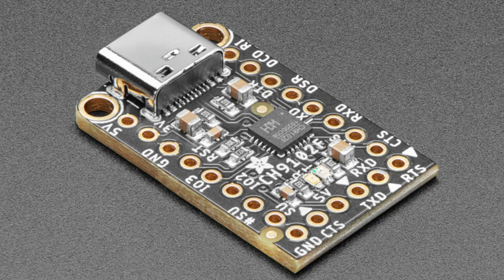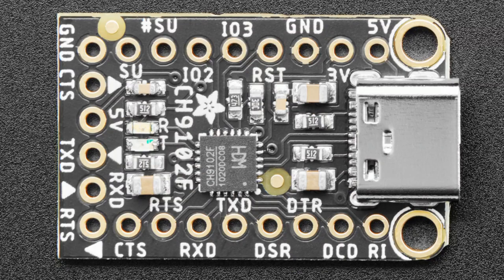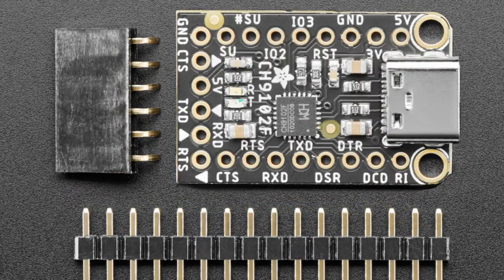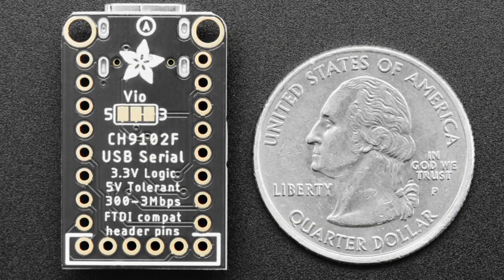This chip is pretty much pin compatible with the CP2102 and CP2104. It has slightly different behaviors, which I'll talk about right now. So a USB serial converter is really handy because a lot of computers have USB, not RS-232, but just about every microcontroller, your ESP32s, your Atmega 328s, your 8051s, they all have a serial port that's like 3-volt or 5-volt.